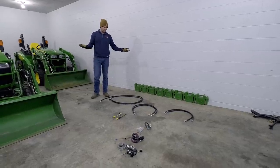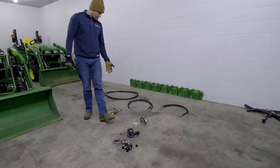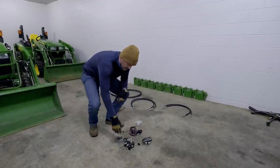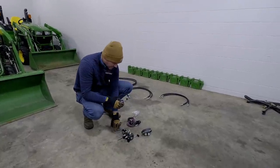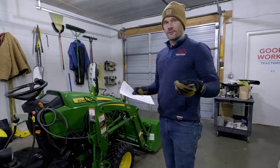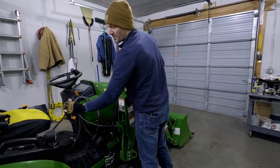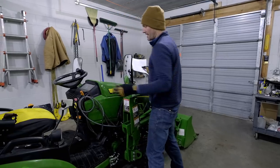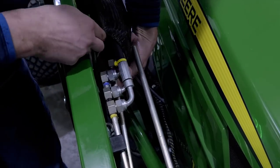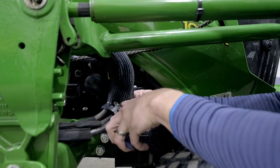This is all that's included — it's really not that much. You have some hoses, little covers for your outlets, and the hydraulic portion that mounts to your loader arm, plus a little bit of electrical too — nothing really to be scared of. The first step is to turn your tractor off, then move the joystick to relieve any built-up pressure in the hydraulic system. We're going to be separating the lines and installing new ones, diverting flow from one direction to another at the push of a button.